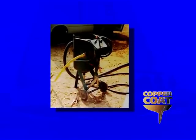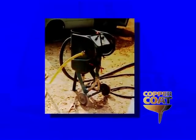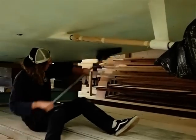The best way to achieve this is to use a low-pressure slurry blast of sand and water, although it's perfectly acceptable to remove old paint by hand, as shown here. Finally, the hull must be abraded to provide a good key for the new epoxy coating. The most efficient method is to use a random orbital sander with 60 to 120 grade discs. However, sanding by hand is again an option. Be sure to remove all the resulting dust before proceeding with the application.